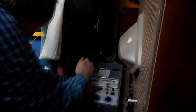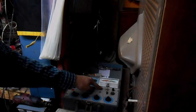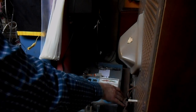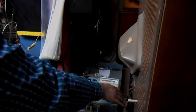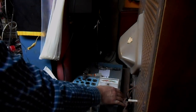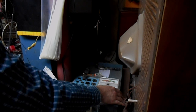You're not having your heater go out on me, are you? You're not. So why is your emission slumping? Is it a bad socket connection? Is it a grid emission issue? No, because the needle would stay up in the grid emission test if it was a grid emission issue. This is just a low quality tube. Crud, now I'm going to have to dig up a good 6KT8. The problem about digging up tubes like this from the used pile is oftentimes you have to find 2 or 3 used ones to find a good used one.